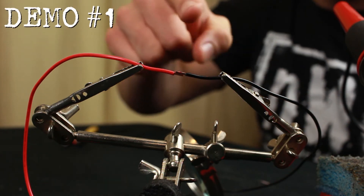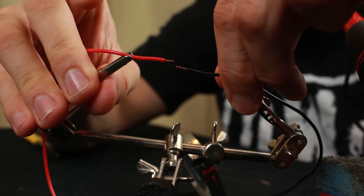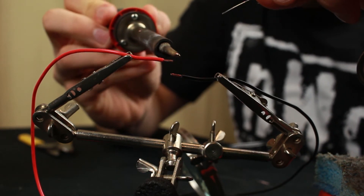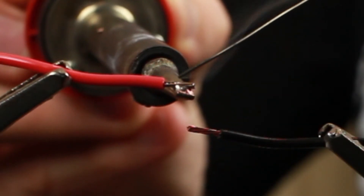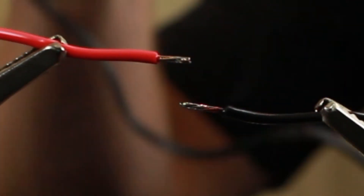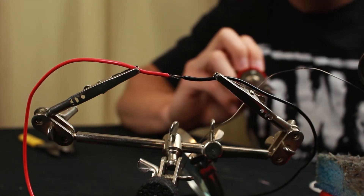For my first demonstration, I'm going to be soldering these two wires together. You want to make sure that the ends of the wires are lined up and stripped clean. Before we solder them together, we want to prepare each wire individually. What's important is that when you're soldering wires together, you don't need to heat the solder — you need to heat the wire. If you heat the wire, the solder should just flow right in. It just makes beautiful contact like that, effortlessly.